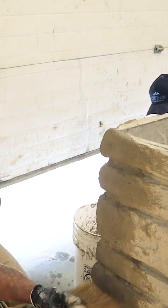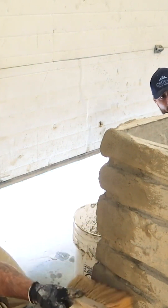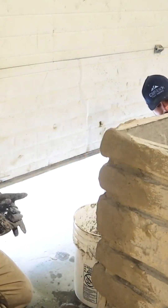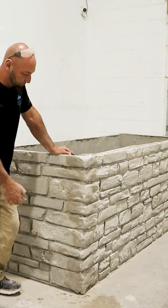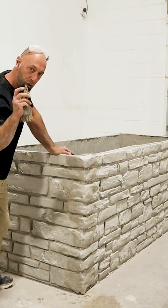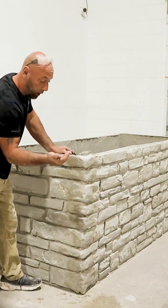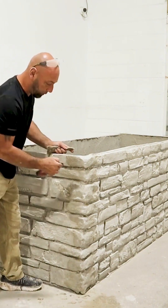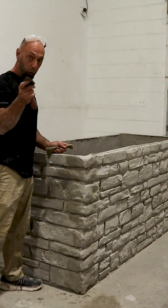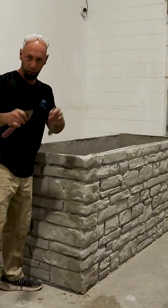Really simple technique — and there's the effect. Just a couple of tools: when you do your grout lines and when you're mudding, you can use the back tip of your brush to scratch out the excess concrete, or just a margin trowel to keep your lines nice and clean. This is really good when you have a dry stack mold because there are no grout lines, but you still have to clean up the rocks. Just a couple tools to use.